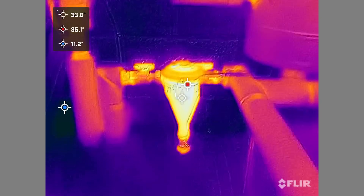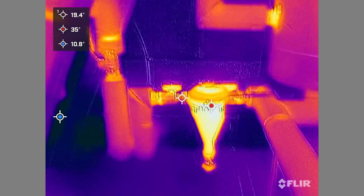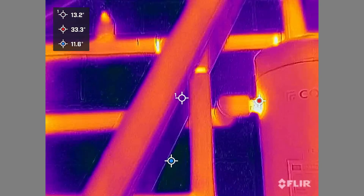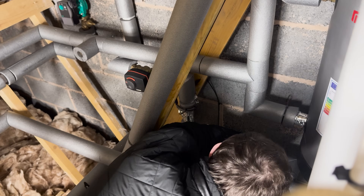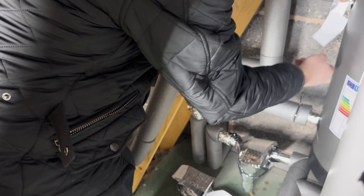The next hot spot was the filter. This filter takes water through it, has a large magnet to remove magnetic particles floating in the system, plus a sump for heavy non-magnetic debris - basically cleaning the water to keep the system clean, protect the radiators, and prevent damage to the heat pump so it works at full efficiency. There's also a Y strainer inside the Cozy 6 itself. Again there's a pre-formed insulation case available but it's an almost impossible and crazy-priced product to source, so I wrapped it with the same foam and foil tape as best I could.